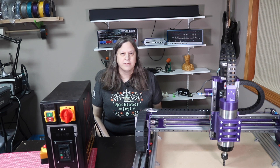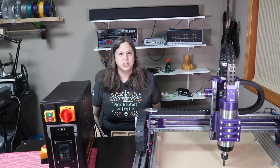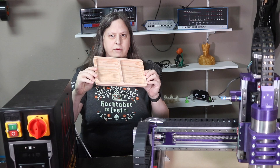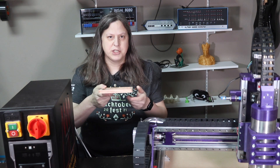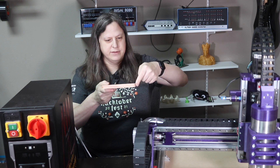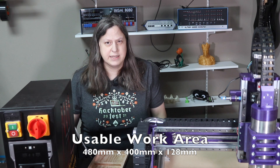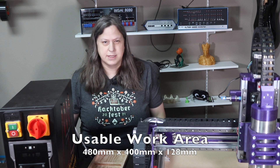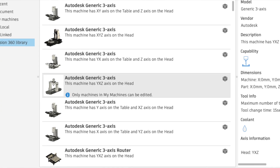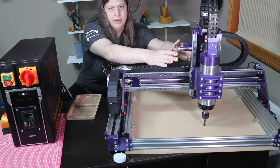After the first attempt there was dust on everything. For the second attempt I ran an extension cord from my other office so I could run the vacuum without tripping the breaker. I'll be designing and printing a dust shoe before using the CNC again because holding a vacuum for eight hours was not fun. Here's the final result after sanding. I set my work offset incorrectly at the start so I ended up much closer to the edge than intended — the correct X and Y origin should be just inside the stock material. The usable work area ended up being 480mm on X, 400mm on Y, and about 128mm on Z minus the end mill length. This is a Y-X-Z router, meaning the Y-axis moves the entire X-axis, which moves the Z-axis, while the work surface stays stationary.